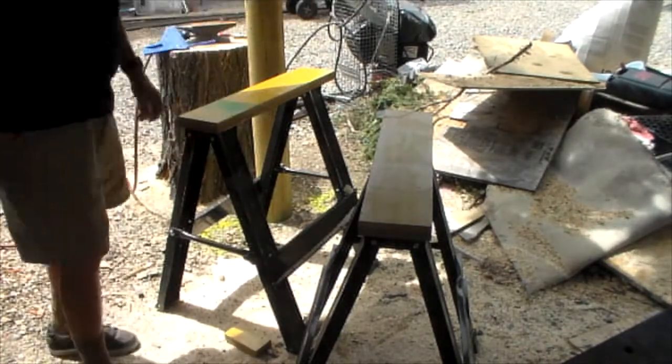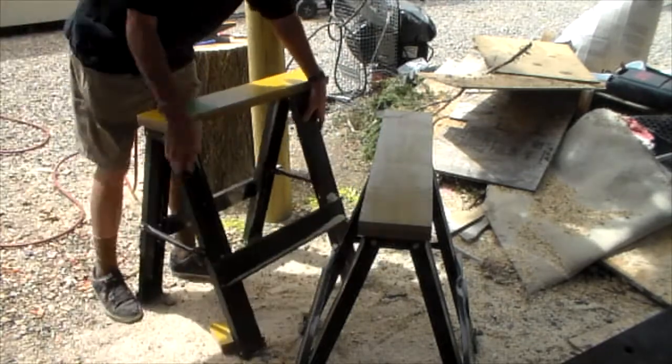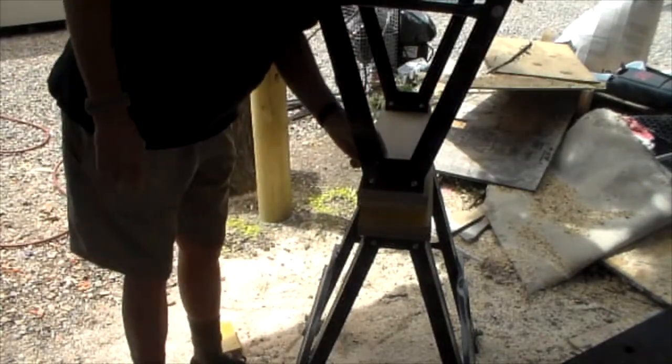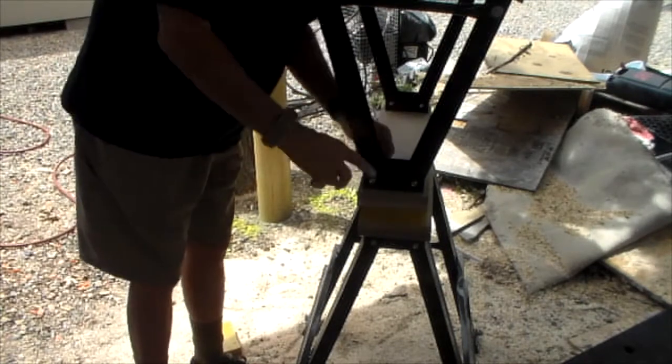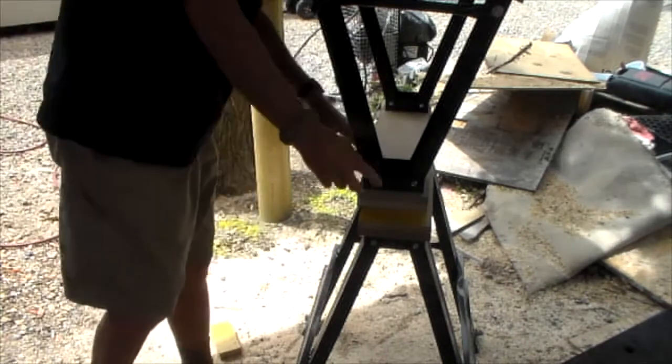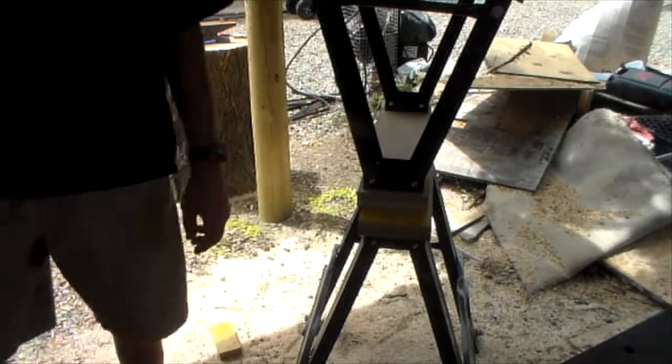The vibration is probably the cause on these. One completely missing a nut, two of them loose, one the nut's ready to fall off. All just from that vibration. They didn't send any lock washers with it, so I'll either do lock washers or lock nuts.